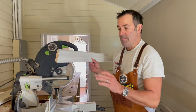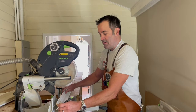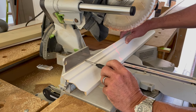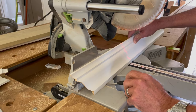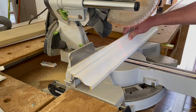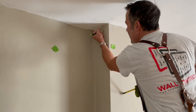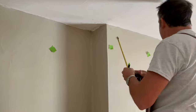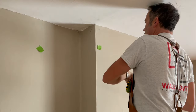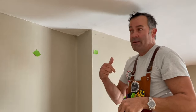Here is a very important part of cutting on the miter saw: you always flip the molding around to the other side — this represents the wall, and this represents the ceiling. Knowing that this side is the wall and this side is the ceiling, all the measurements of the room are going to be taken and marked on this part of the molding. Writing along the wall really helps because if you forget it at the saw you can always come back and look on the wall.